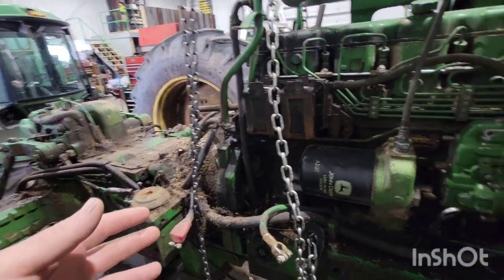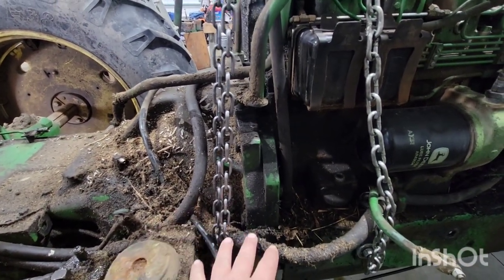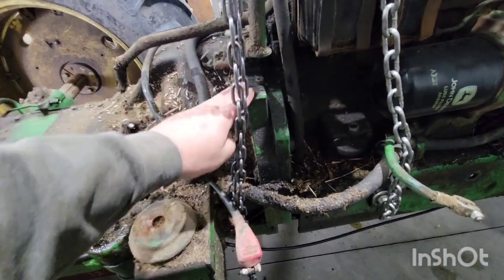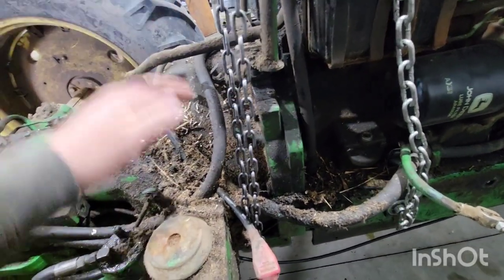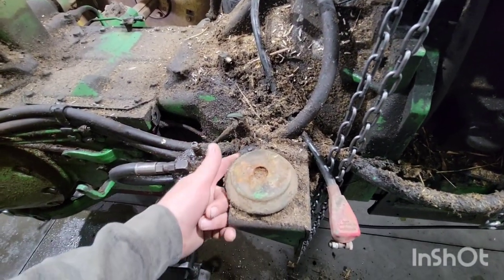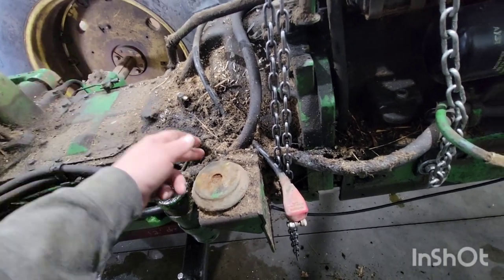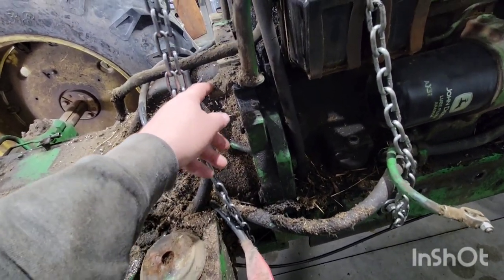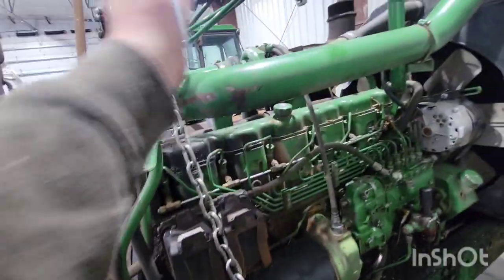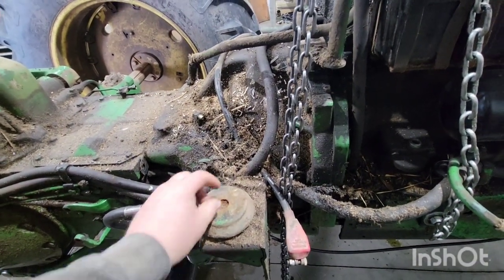On the right-hand side, your cab mount is here. I take the battery boxes off just to get them out of your way — that opens up a little room. You've got the cab here and it kind of goes up and over, so this fitting here is a little pain in the butt. There's a 3/8 bolt coming from the bottom side — no nut — it's supposed to be for your ground strap that runs up to the cab. Then your throttle bolts right here, just a turnbuckle, then your kill cable, tach, wire harness, and steering lines.